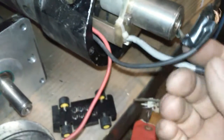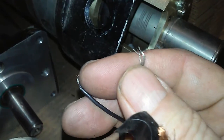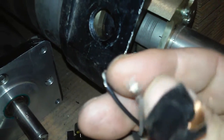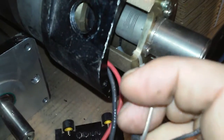This is the tachometer leads. Now if you get these tachometer leads reversed going into the controller, that motor will over-speed. It's going to go nuts — it's going to try and take off like a siren and then it's going to shut down. So if you get those reversed, it can cause problems.